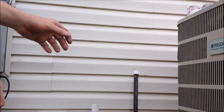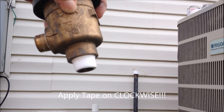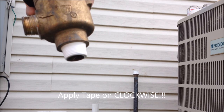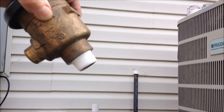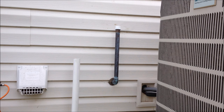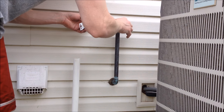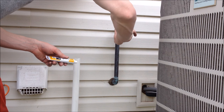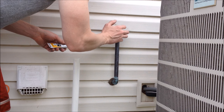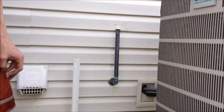I went ahead and cleaned up all my fittings and connections here. You can see I've already applied Teflon tape on this one. Remember to put your tape on clockwise, and better safe than sorry — do about 10 full circles. Make sure you're cleaning up all the old Teflon tape or paste and getting that all off, then re-tape it. I'm also going to put a little bit of paste over the tape as well, just for added security. That way we're doing everything we can to make sure it doesn't leak and we don't have to do this job again.